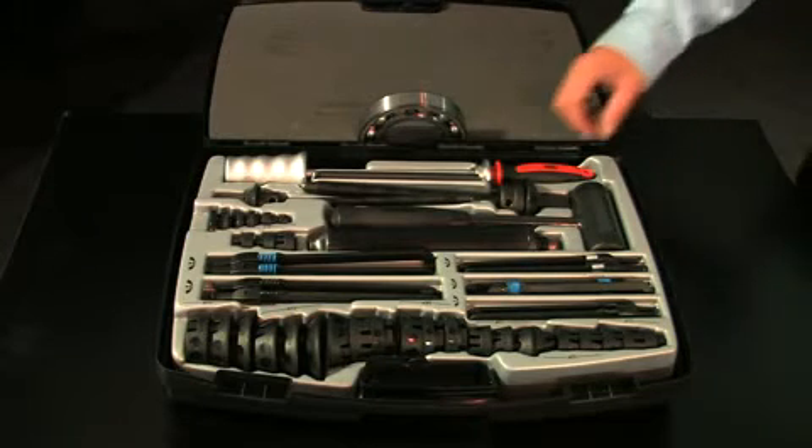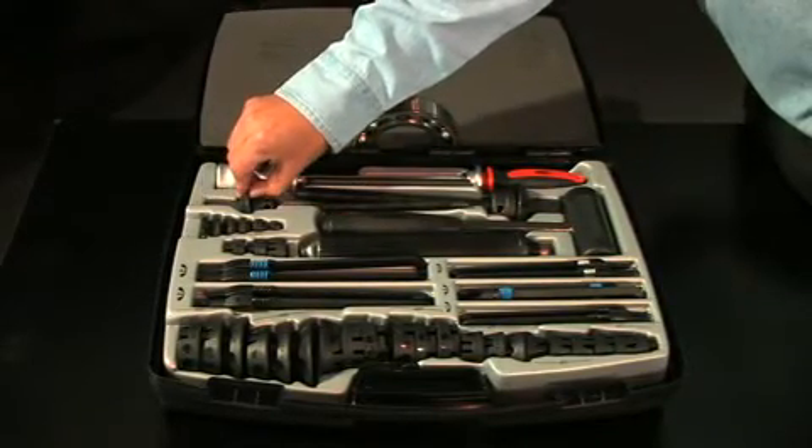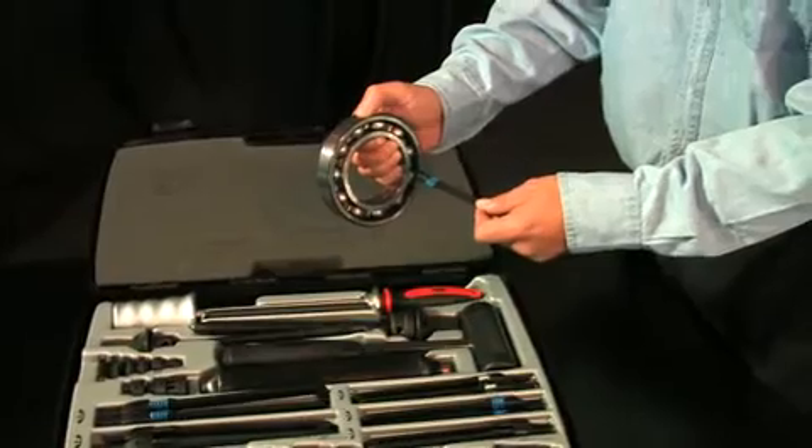Let's take a closer look at the dismounting kit. The dismounting kit has two spindles and puller arms, each designed for optimum grip on the bearing and the puller handle. The puller can be used for dismounting deep groove ball bearings with an interference fit on both rings.